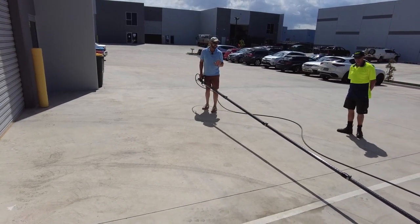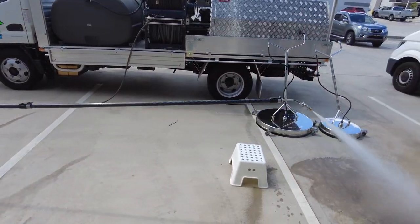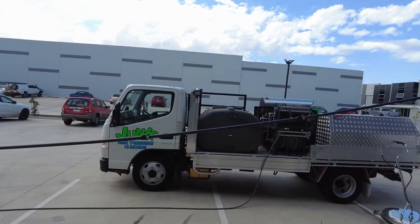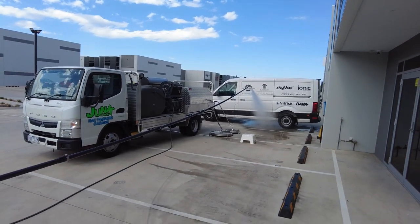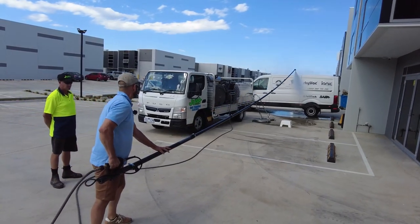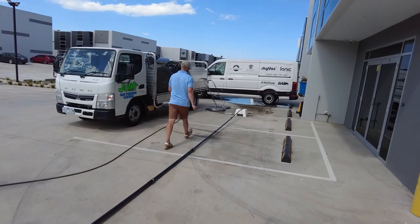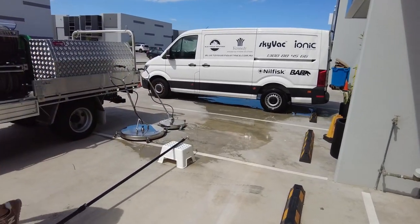What we've done now is added about 15 degrees to that pole. The machine is not running at its maximum performance. The tip is balanced but we've actually got a little bit too much adjustment on that tip, and I'm going to adjust that and show you how that's affected. The pole now wants to go up under its own steam, so I'll drive the pole back down and won't let go of the trigger until the pole is on the ground. I'll make a slight adjustment at the tip and we'll go back and fire that pole again.